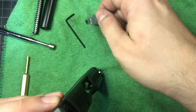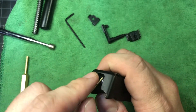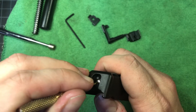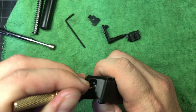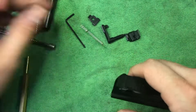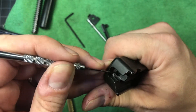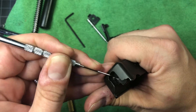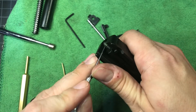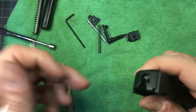Push your toggle in, push in on your firing pin, and then push up on your backing plate. Just pull that out — the pin is out. Now push this back down, push in your plunger, and your firing pin falls out. Down inside of this well is a spring, and we can pull that out — that's our firing pin spring.